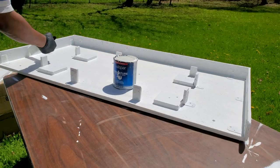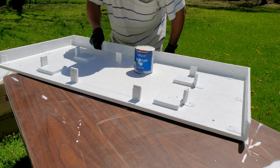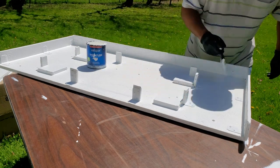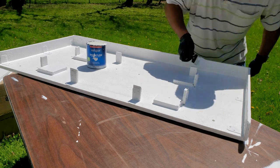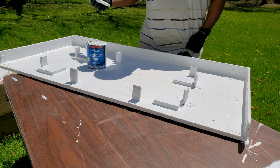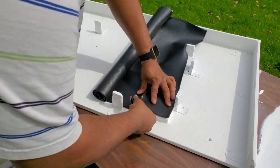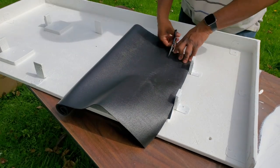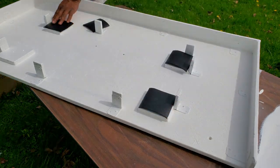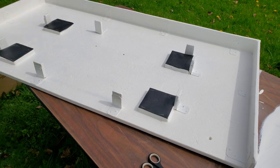Now I'm going to go through a little vinyl caulk and fill in the cracks to give it smooth edges when I paint it. Then I'm going to go through it with flat white paint and paint the inside and outside of the unit. The reason I painted the interior is because I'm putting LED lights on the inside, and we want all that light to bounce around inside there as much as possible. Plus, when you lift up the lid, you want this to look as professional as possible. One thing to note when painting: I use regular paint that I can put on with a brush because it spreads out more, you're going to get more coverage, and you don't have to do as many layers as you would with a spray can. I would definitely go this route for your first couple layers, and then you can use the spray can if you want for the last layers. I use flat white paint on everything including the top, but when the top dried, I went back and used a high gloss paint for the top so it will be shiny. After the painting was completed, I used some drawer liner on top of where the feet are going to go, so this will help with vibrations and so the bottom doesn't get scratched.